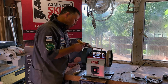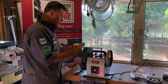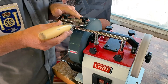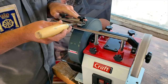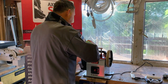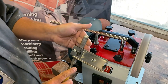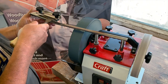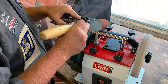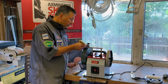You can do a dummy run first — just a score to double-check where you're sharpening. Now we're going to have the stone running toward us. I've already filled the water trough up, and it's just a case of very gently running back and forward. You can put your fingers close and have a quick look to see where you are. After this I'm just going to do a very slight hone.